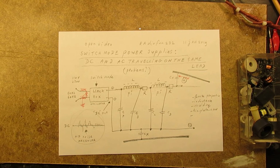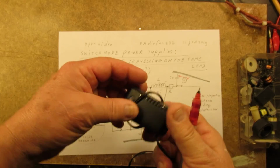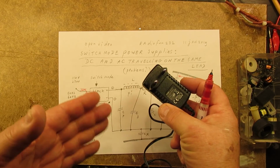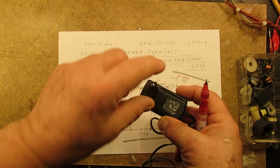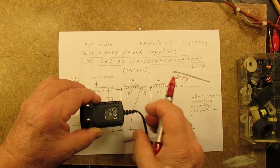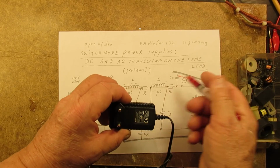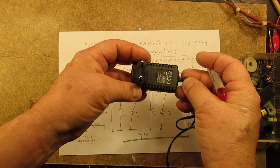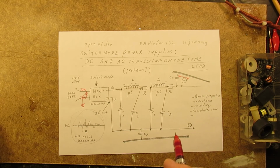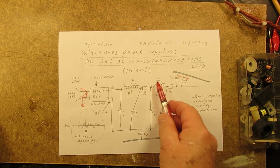Such a power supply strays out a lot of frequencies, it's unshielded, so mount it in a metal box, especially from tin plate or steel, with the wiring to the outside, then from the positive to the negative this filter, and then small capacitors to the outside, to the tin plate where the whole thing is built in. I had very good experience with that. I once had a satellite receiver of which the whole logic circuit got deteriorated by the bursts of the switch mode power supply. So all the channels went away.